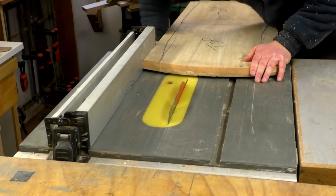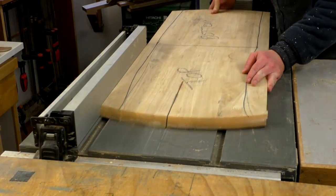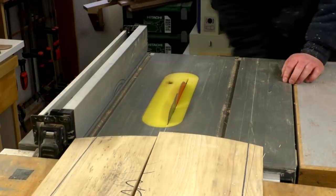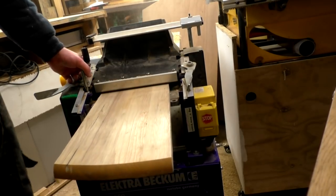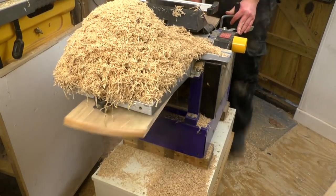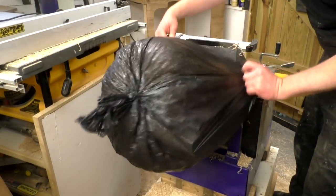The remaining piece would be too big to fit through my thickness planer so I made another rip cut through the top and bottom panels and I will later rejoin these panels by gluing them together. So then it was over to the thickness planer to try and get rid of those stains on the wood. I made multiple heavy passes — you can see from the shavings that I took quite a lot off the thickness from each panel.